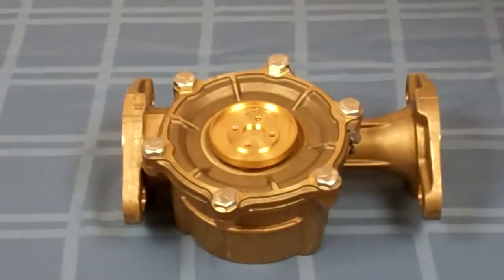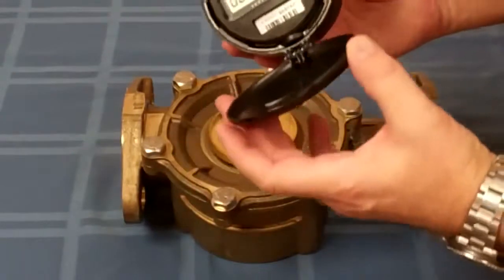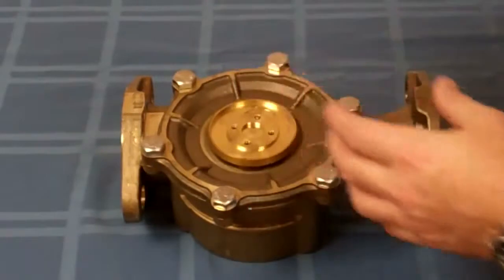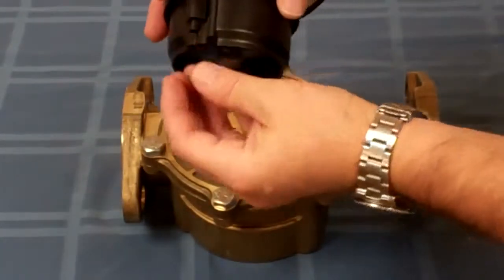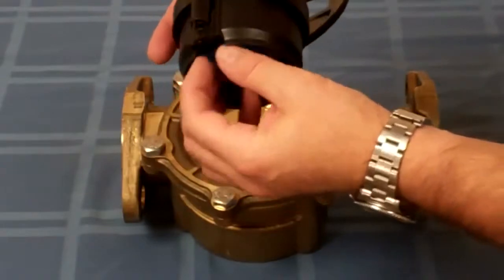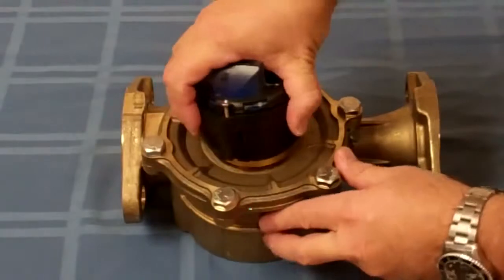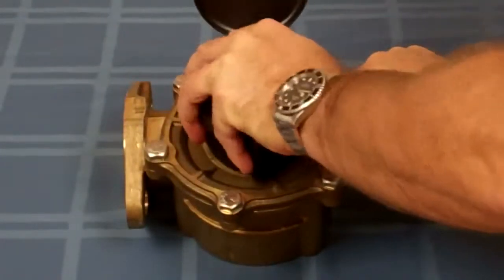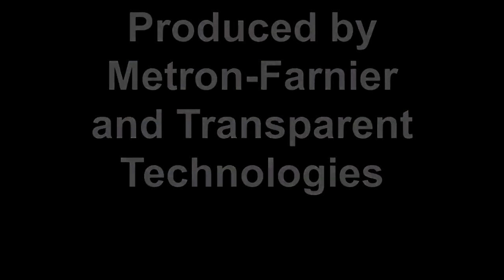I mentioned there was a second way to install the register on the register plate. That simply amounts to putting all the components of the register into place and then setting the whole unit down on the register plate. The installation is the same — it's just important that when you put the slide crimp in, you get that screw started enough to catch that crimp. We want to leave it with enough play to expand so we can fit that over the register base. There we go — and then you just crimp it on.